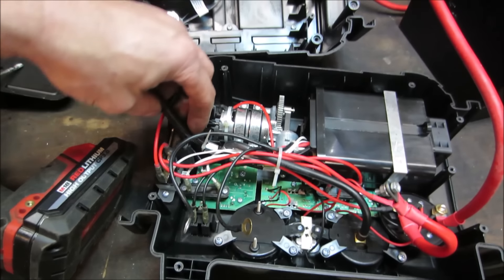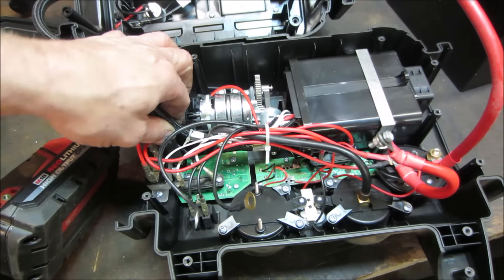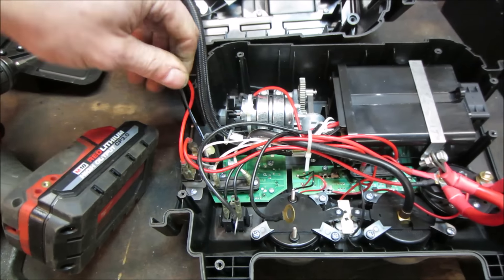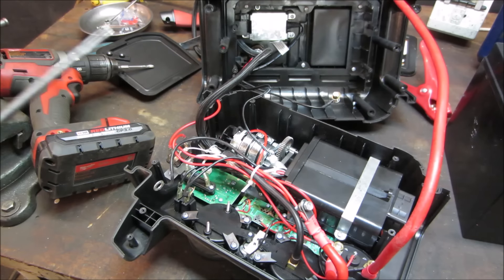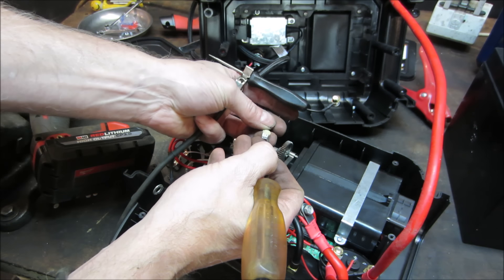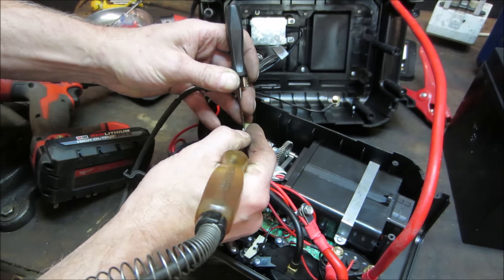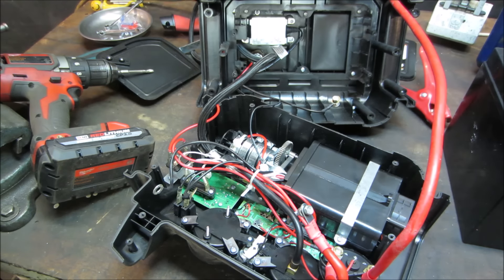Can we just plug it in? I don't know if we could plug it in - let's pull that off and just see if it's putting 13 volts out to go charge the battery back up. I don't want to break it off the tab. Maybe we can probe that - let's go plug it in, see if any voltage is coming out of that. I don't have probes that small for my meter but maybe we can get it with a test light. Yeah, there we go. Definitely would have been enough to charge the battery back up.